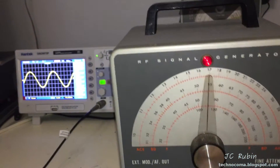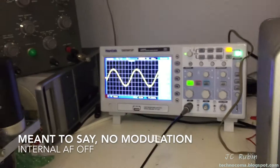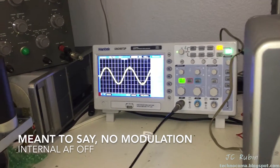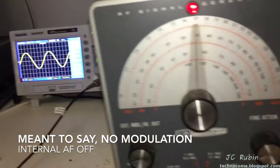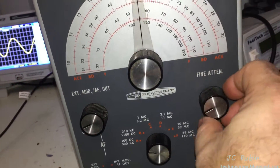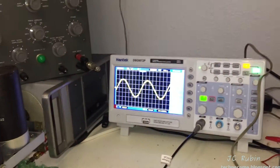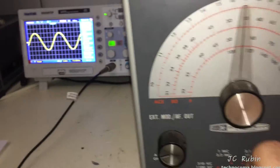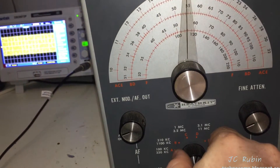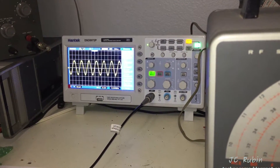I put this in the middle right here. I shut off external modulation only because I'm measuring the RF — it makes it a lot easier to take a peak-to-peak value without modulating an AF sine wave onto it. As far as the attenuation goes, I have it set all the way for high, and this knob is turned all the way clockwise for maximum output signal. I went through the different bands and you can see that some of them have a greater frequency response than others.